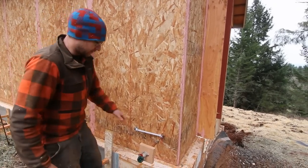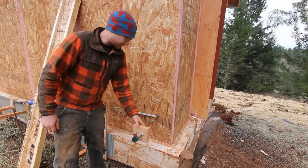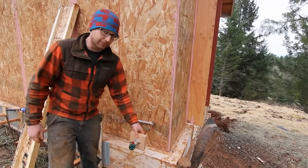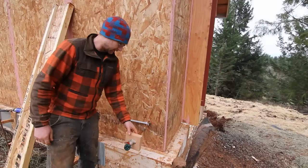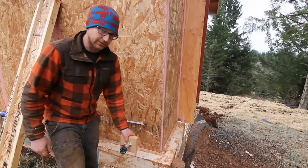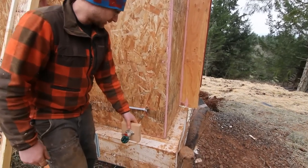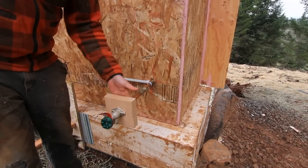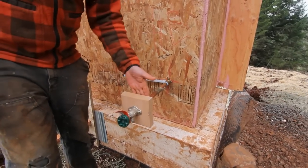We had our plumber rough this in with the block because we knew we wouldn't be able to put the block on later, and we didn't really want to cut the block in half and put it in later. With the assistance of the sider, the plumber, and myself, we figured out the depth to the back of the block — the back of the block is where the rain screen is — so eventually the siders will be building out behind us.